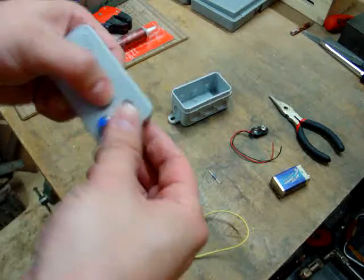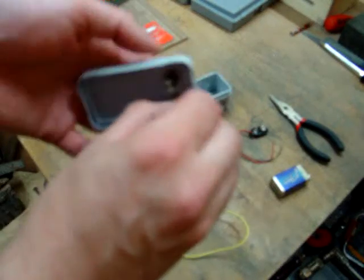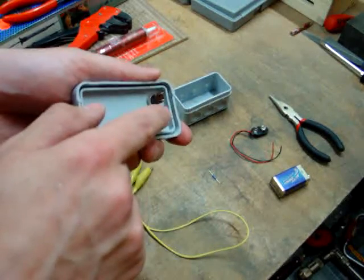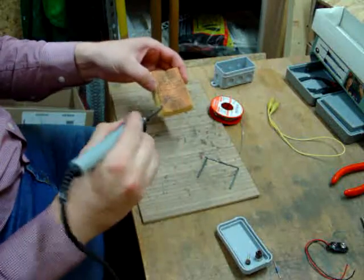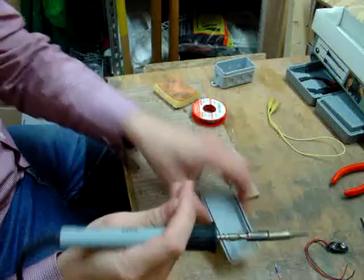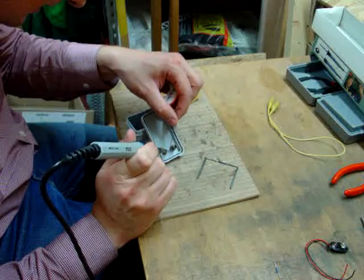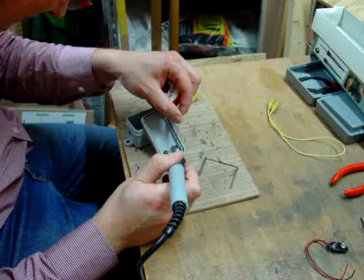Let's put the LED in — first the clip. You can leave away the clip; it just looks nicer and since I have it, I'll use it. Put the LED in from the back. The orientation of the pins doesn't really matter right now; it's just important later on when soldering. I'm using simple soldering iron with some tin. I'll first put some tin onto the short LED pin — that helps later when soldering on the resistor — and also put some on the pin of the button.